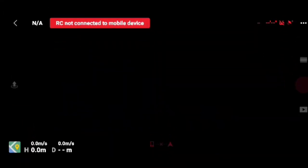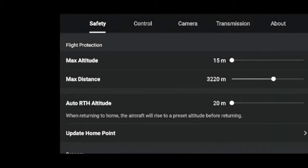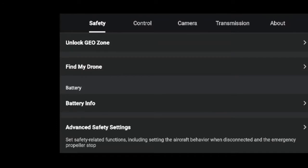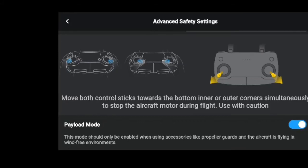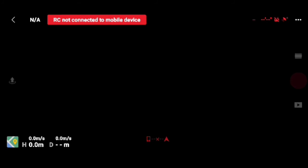Once you open up your DJI Fly app, you'll see the three dots in the top right corner. Click on that and this menu comes open under the safety menu. Scroll down to the bottom and you'll see Advanced Safety Settings. Click on that and scroll down again — it says Payload Mode. It says this mode should only be enabled when using accessories like propeller guards and the aircraft is flying in wind-free environments. Turn that on and the blue light will come on. Go back and you should be able to fly more than 100 meters with that enabled. Sometimes it doesn't automatically detect the guards, so you may need to turn it on manually.